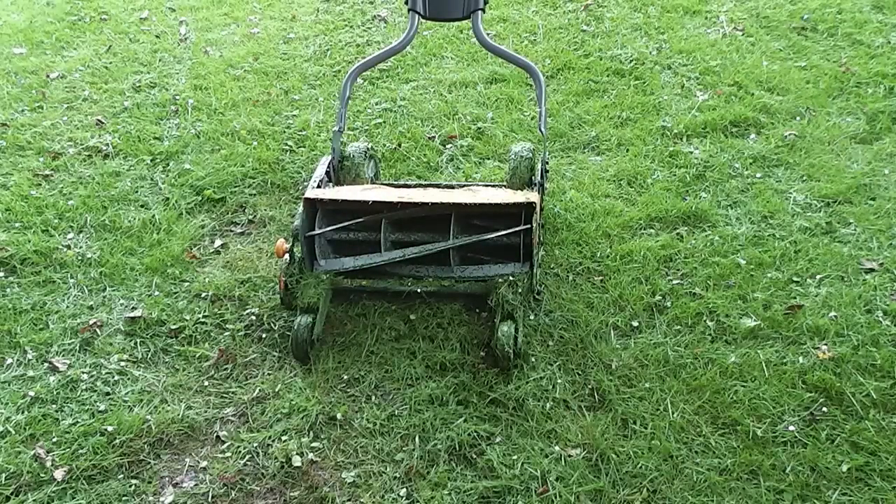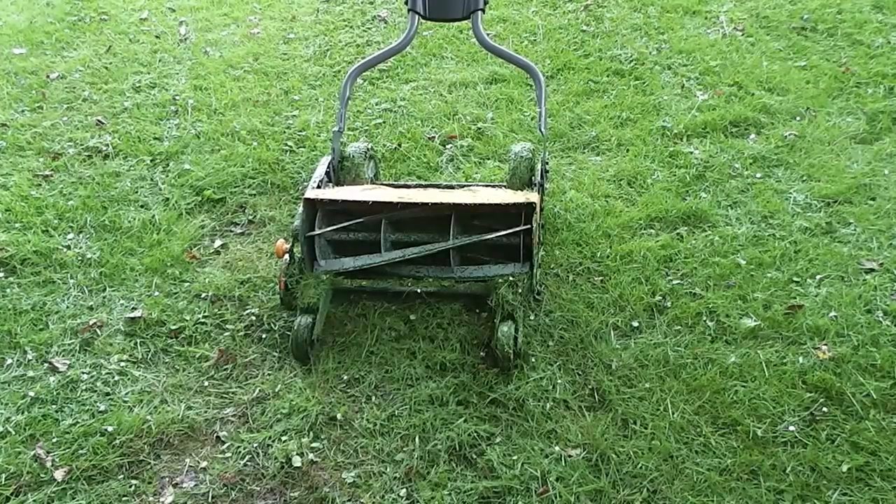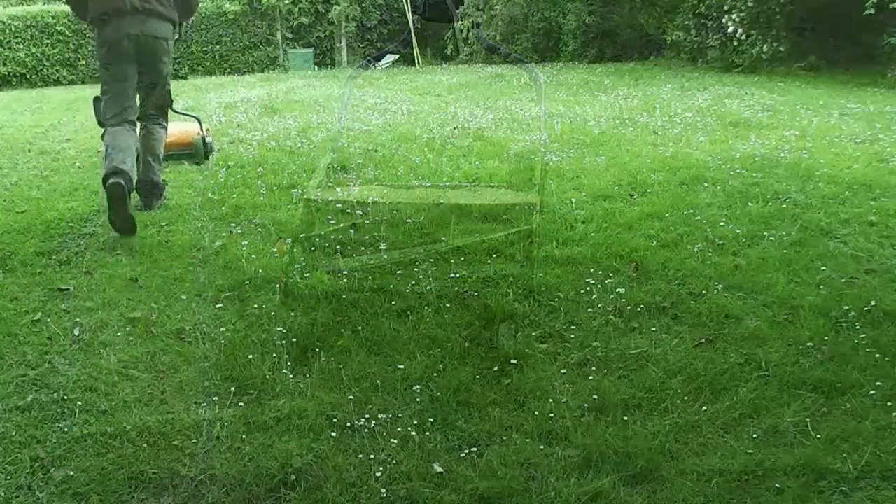The guide wheels at the front and the drive wheels, which are connected to the gears for the blades, are set narrower at the back — set inside the cutting width of the blade. Very simple idea, why has nobody else thought of that? It's brilliant. Rotary mowers are a nightmare — the blades are always 2 inches in from the width of the wheels. So that's brilliant.